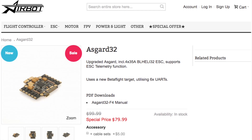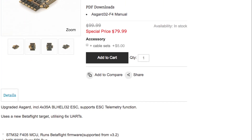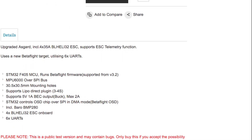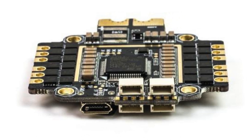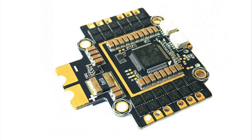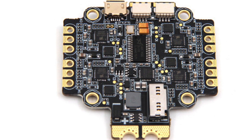While we're on the subject of flight controller boards in beta test, the Asgard 32 seems to be the next-gen of all-in-one boards. Not only is it an F4 flight controller using an STM F405 MCU like the Omnibus Fireworks, it's got 6 UARTs, a 5-volt battery eliminator circuit, barometer, OSD, and a direct 4-to-6S LiPo connection. But it's also got an integrated 4-in-1 BLHeli 35A ESC with ESC telemetry on board — it's incredible. I've always found all-in-one boards a bit noisy due to PCB layout and how close sensitive components are to noisy ones, but the latest products are getting really good.